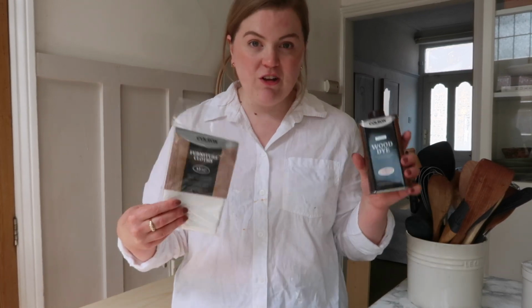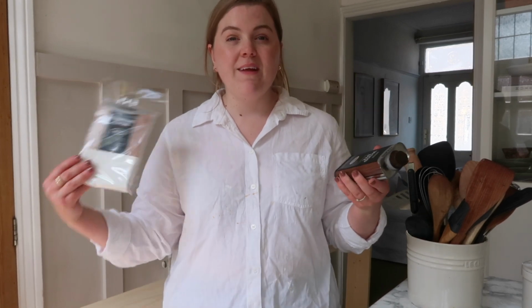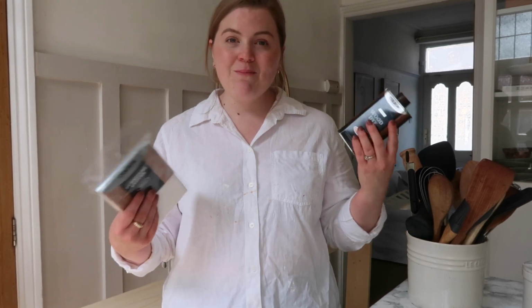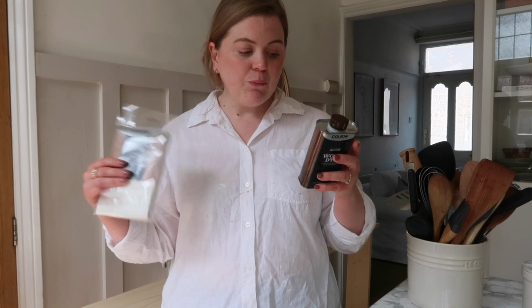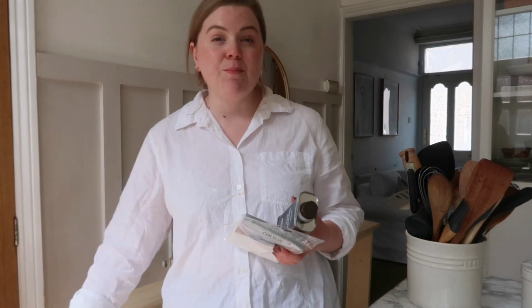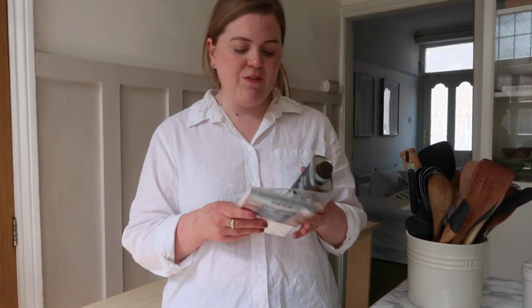I also have furniture cloths. This stuff is relatively easy to do. It penetrates the wood, so you're going to see all that grain, which is great. You only have to leave 1 hour between coats, so it recommends 2 to 3. So we'll see how we go, how easy it soaks it up. I think because it's a pine and it's sawn, it's going to do it really, really well. So I think after 2 should be fine.